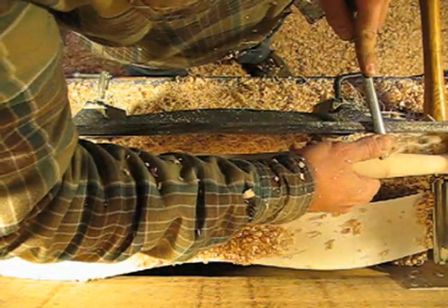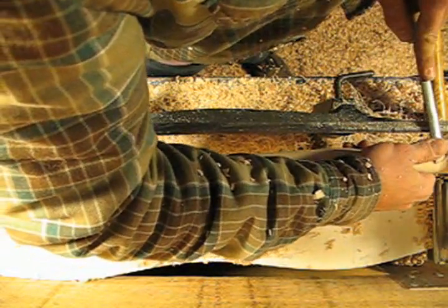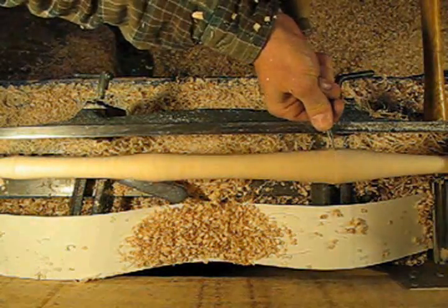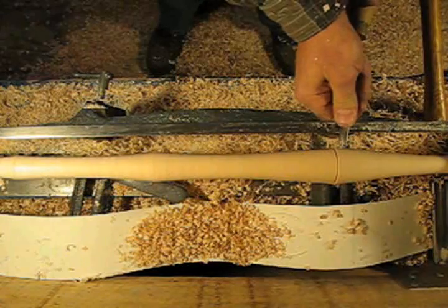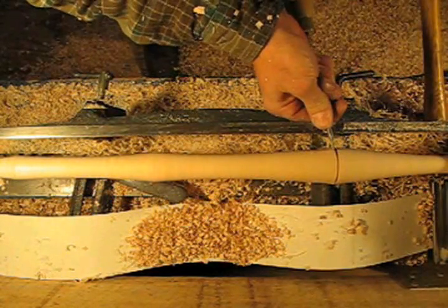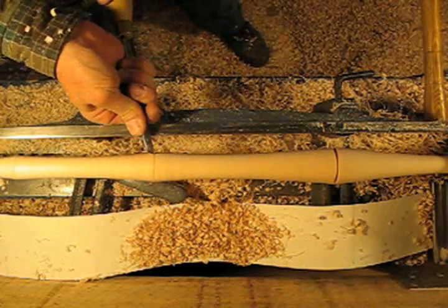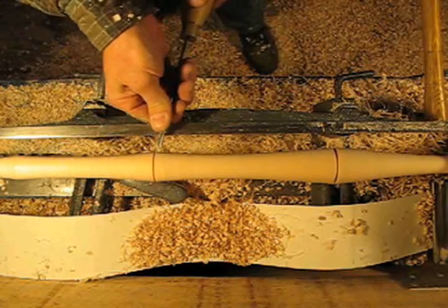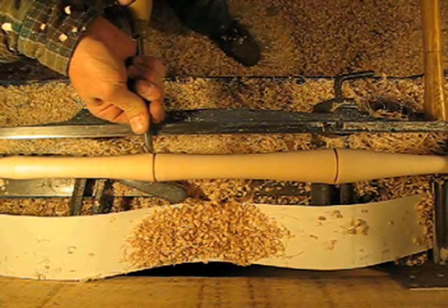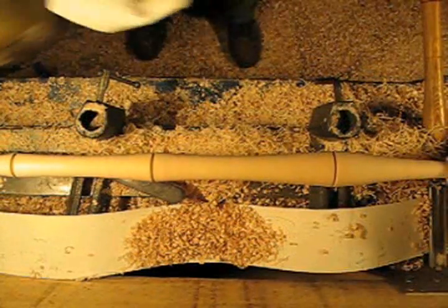In this instance I've chosen to do the skewing at a high speed, which is unusual for me. I normally like to slow down with the green wood I use, but I've found that with this dry hardwood, a faster speed actually helps out. Now I'll go ahead and cut those V-notches — they're going to help define this leg. This always tells me I'm in the home stretch.